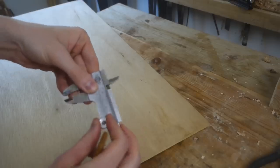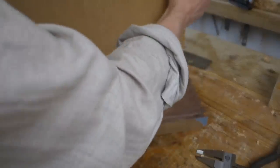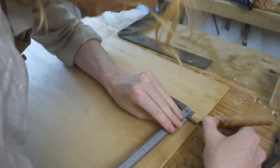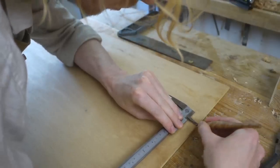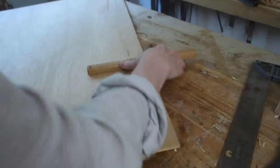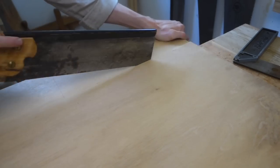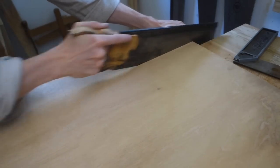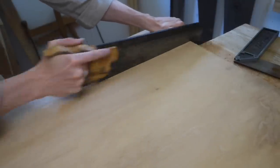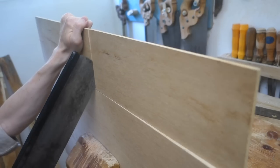A bit odd for what I'm going for here, but I have this sheet that's a relatively good match for the oak I intend to line the inside with. And I wanted the stability of plywood because of that lining I'll be putting in, since it will inevitably push some glue onto this panel and lock it in place, possibly causing cracking if I use the solid wood bottom. It's a narrow box, so you could probably get away with it, but I'm still not confident at estimating shrinkage rates, and I wanted to play it safe.